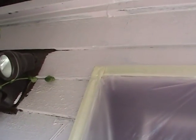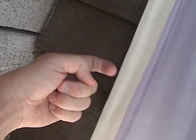If the white tape is out in the sun, do not leave it on overnight at all, okay, because the paint will stick to this surface, it will stick to the new paint, and you've got problems. But we use the 1.5 inches on everything. The reason we use the white tape is it's got so much stickum on it, it makes a real fine line and paint doesn't get underneath. That's why we use white. And I've used hundreds and hundreds and hundreds of rolls of it.